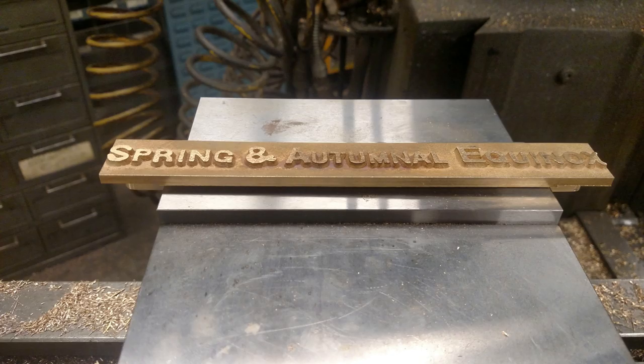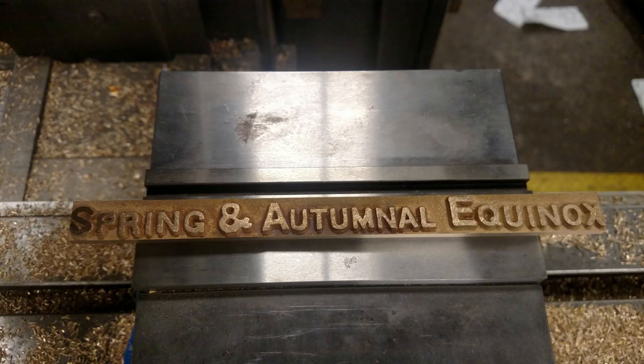For the last operation I was gripping on the tenon that I had just cut and I just needed to machine away all that excess material on the side that has the letters. This is where things started getting weird because the lettering was mostly straight, it just wasn't really spaced all that well when they made the pattern. You can see that 'Equinox' is a little bit higher than the other words and 'spring' is kind of put in there at just a bit of an angle. I just machined away as much of the material as I could — I didn't want to machine down just above the lowercase letters because that would cut into the tenon and I didn't want water to leak down into that slot and potentially corrode the manhole cover.